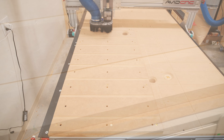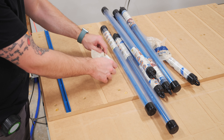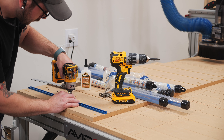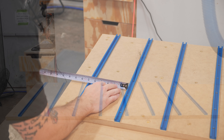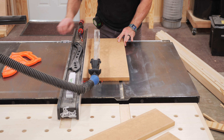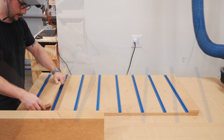I chamfered the holes for the threaded inserts and got them installed in the panel, then got the Rockler T-track installed, which was super simple with those pre-cut mounting grooves. I initially just screwed down the T-track using some number 6 screws, but felt like they didn't have quite enough holding power in the MDF, so I added a bead of CA glue to really lock the T-track down, with the screws acting as clamps while the glue dried. I rinsed and repeated for the rest of the T-track pieces, then ripped some MDF strips from the other piece of MDF at the table saw.